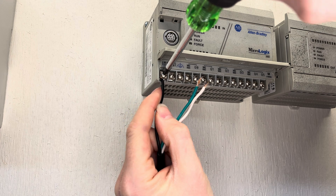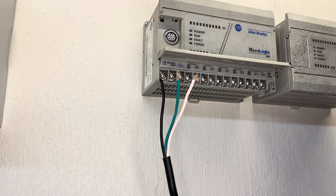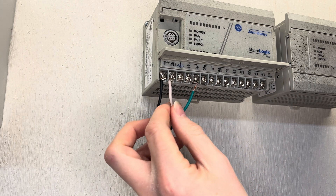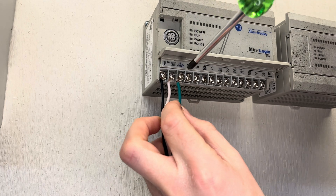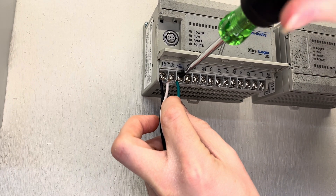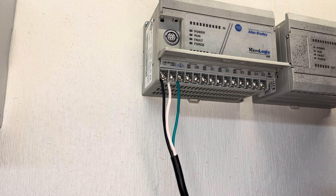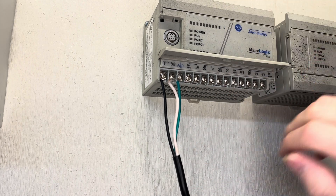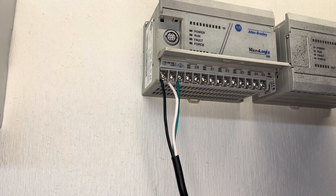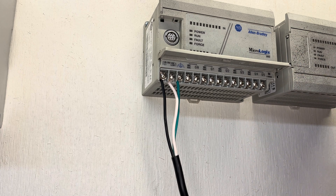We're going to go ahead and put line one in — line one is generally always going to be, in common electrician terms, your hot. Line two, generally speaking, is going to be a neutral, or it would be the line two of a load carrying with two current-carrying conductors. In our case it's a neutral, so we're going to put the white wire neutral in there. And then as always, you're going to have your ground. Because these are plastic, you don't really have the risk of shock from the enclosure, but the ground is protection for transients coming into the controller. That's not to be confused with a shielded cable or shielded wire going to your outputs or inputs — you'd want to tie that shield into your ground or a connected terminal block on a DIN rail so that transients will go directly to ground.